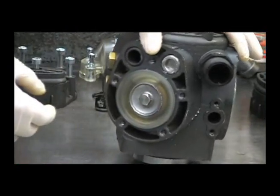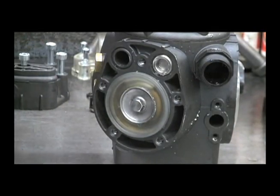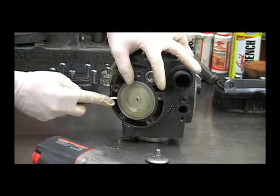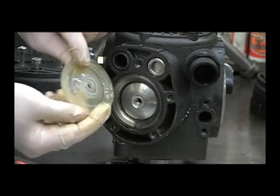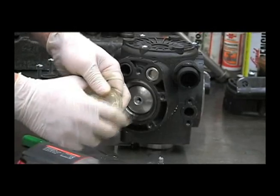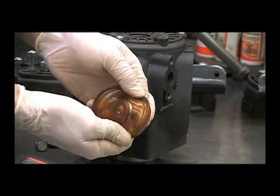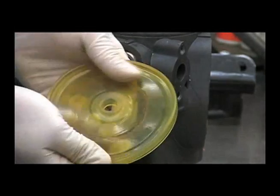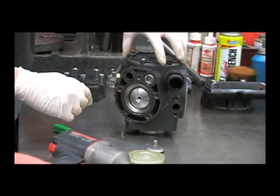We're actually going to remove them to get a better look. Note the orientation of this washer — the sharp edge is facing away from the diaphragm. We'll use a 13mm socket to remove the diaphragm retaining bolt. You may need to use your screwdriver to gently pry the diaphragm out. Notice that there's lettering on one side and the other side is smooth — during reassembly, that will be important. From here, you can bend the diaphragm and look for any cracking, splits, or excessive wear. Here's an example of a worn-out diaphragm that is split. You may also notice a wear pattern, or if a chemical has been left in the pump for an extended period, it may break apart in small chunks. Do the same for all three.